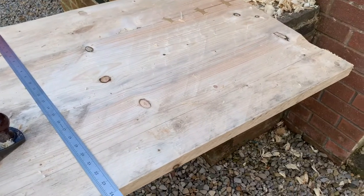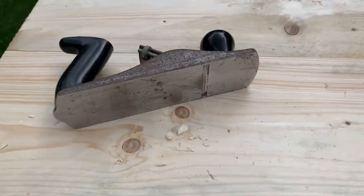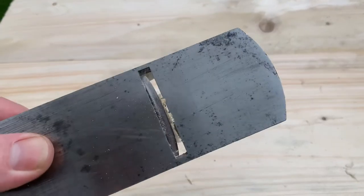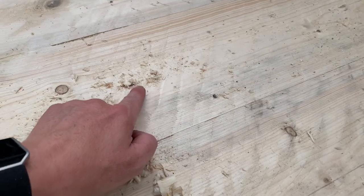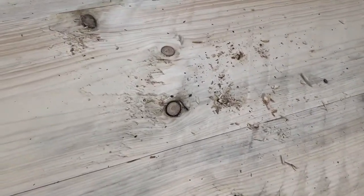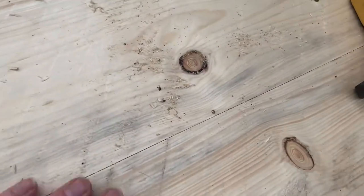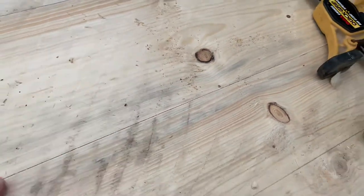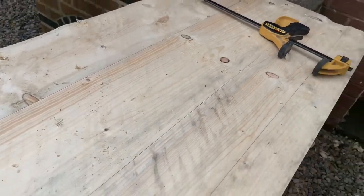That's about two minutes — we've got a two-foot strip done, which creates quite a pile of shavings to start us off with. I decided to break out the scrub plane — you can see it's got a big curved blade on it and a really thick cut, so it takes off great big chunks in one swoop. Each of these little grooves is one pass with the blade. I'm a little bit wary with pine, especially with lots of knots in it, as it can be a bit savage in places. We've used the scrub plane, now we'll go back to the number four and see if we can level that off. I don't mind if there's a little bit of texture left in, but it does need to be perfectly flat across there — otherwise your computer monitor is going to go all wobbly.